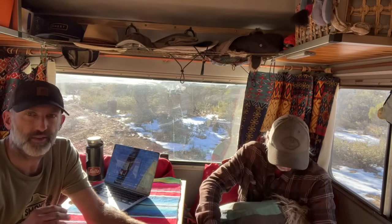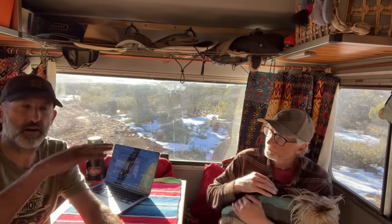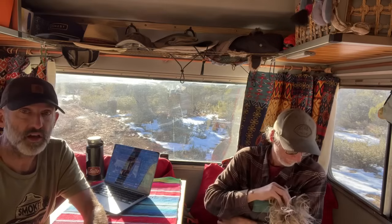But what it is, I've got a shipping container. I actually have a video about this on my channel that I posted this past summer, which shows how I operate the well. Everything is now contained in a 40-foot shipping container. The generator's in there. We've got a water reservoir that fills up with the pump, and it pulls out of there. Everything is contained in there. It's also heated in the wintertime so that it doesn't freeze. So we can get water even if it's negative 20 out. You can pull up and get water immediately.